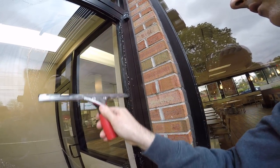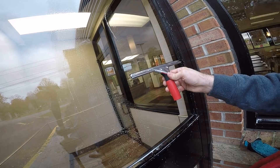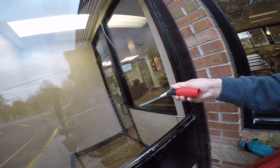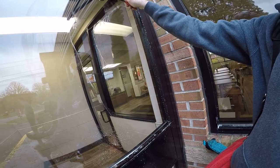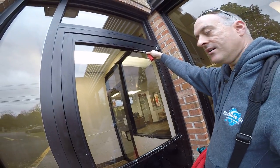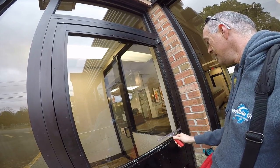I can see what I'm doing wrong here. What's important here is your angle — you want to get that pretty much as close as you can to the glass. You don't want it up like this because then you'll start getting skips. And then when I go into that corner I've got to bring it up like this to get it nice and square right in the corner, and then keep it that way all the way down, and then you will get the zero detail.